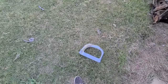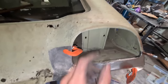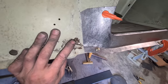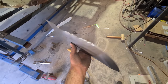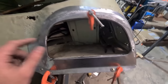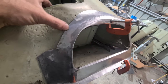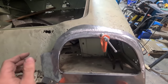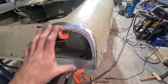After my dummy spit trying to salvage it, I drove over the top with the die on the little hammer trying to planish — yeah, munched it pretty good. So now I'll just remake the top section, which is annoying because this was the hardest part. Starting again — trying to make this top half again and not run it over at the end after hours of bashing. After my little tantrum I fixed this area — welded in a whole new section because I drove over it with the dies and crunched the hell out of it. But it's salvaged — kept the lower half, just welded the little splits in the very corners, and replaced that section.